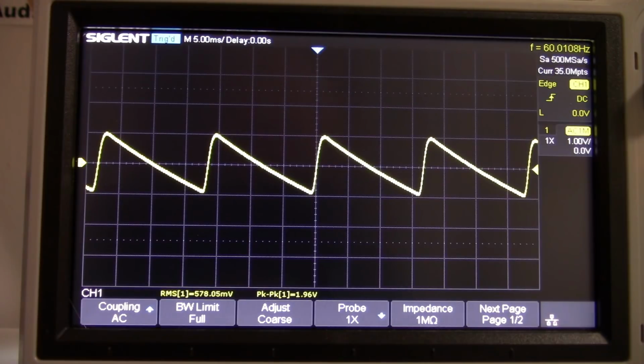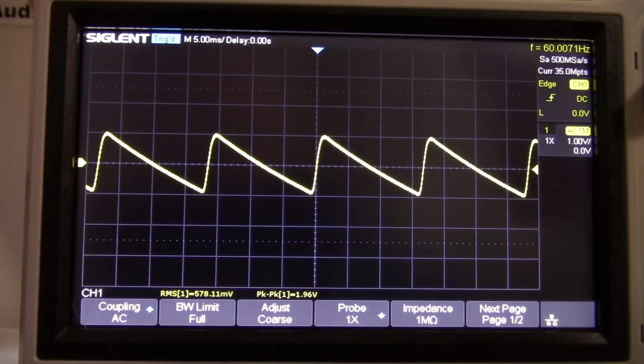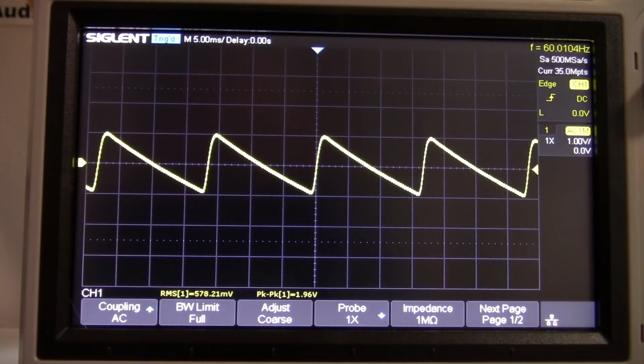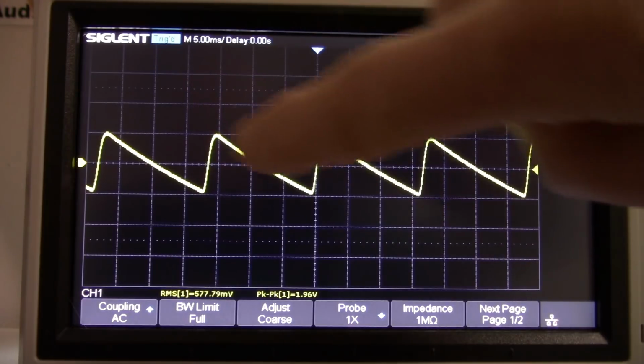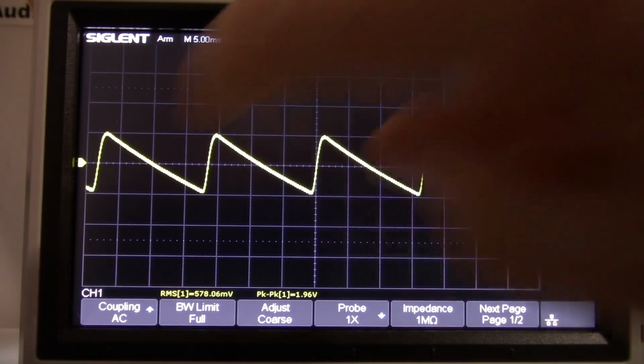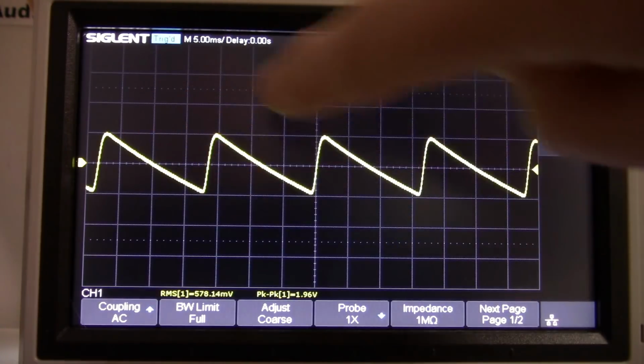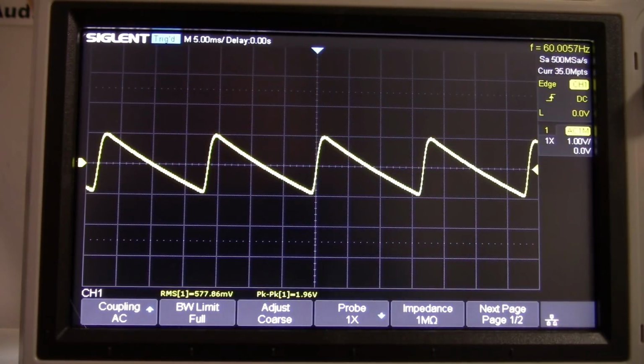And we're back to our 2-volt peak-to-peak ripple. Very excessive. Remember, we had even more than that with the load of the preamp when I was doing that music sample. So it does show how global negative feedback really removes that. It's called SVR, or supply voltage rejection. It's how the amplifier can ignore or reject noise from the supply, and it does pretty well.